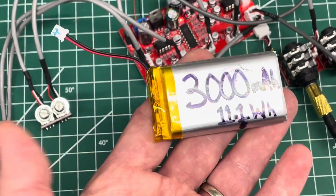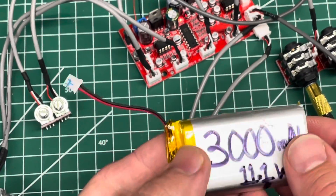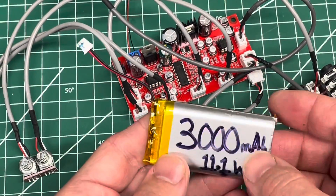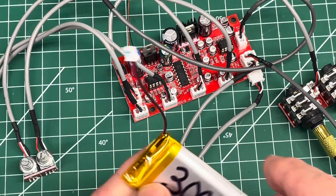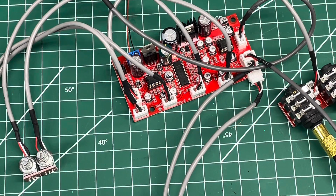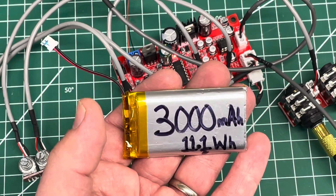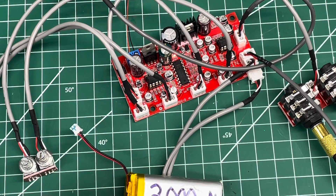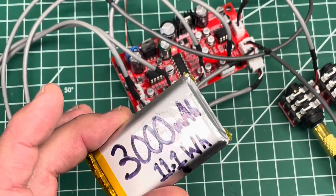Something to think about is the voltage — it's 12 to 24 volts DC. If you wanted to use a 3.7 volt LiPo battery to conceal inside a helmet or armor, you could do that — you'd just need a voltage booster, sometimes called an up-converter. They're out there and pretty inexpensive, less than 10 bucks. Some are fixed for up-converting to 5 volts, and others up-convert to different voltages. You can find them easily on Amazon. So it's doable if that's something you wanted to do.